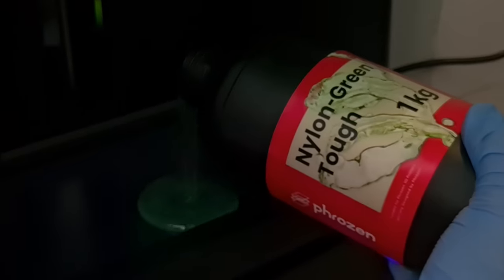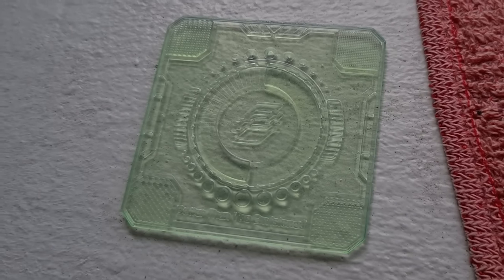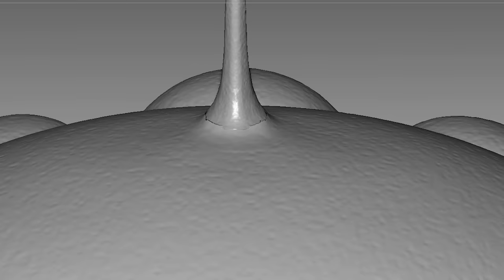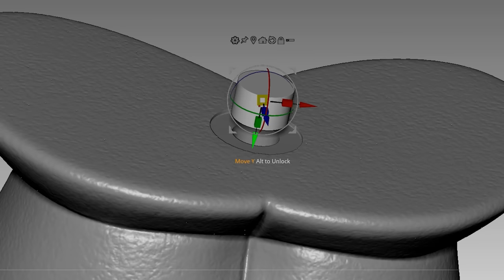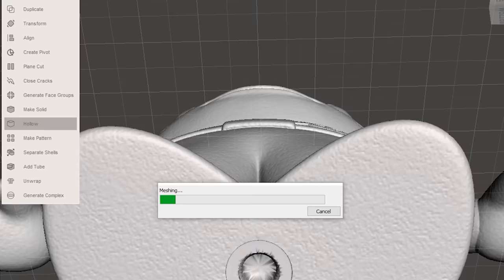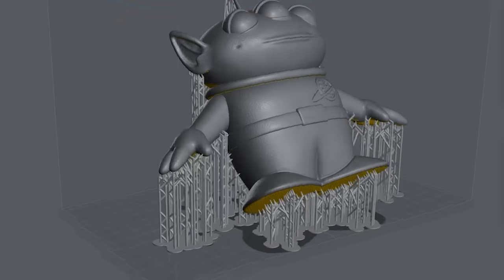Today I'm going to use a resin with a slight flex, and this is where you should stop filling — otherwise it might overflow. I did some quick exposure tests and it looks great. So I started preparing our 3D model. Obviously the first thing to do is to retrieve the thin antenna and replace the thick one. I added some noise to it and merged the ends together seamlessly. The next thing was to poke a hole through his end, because the factory dealt with the squeaker part and I happened to have the same squeaker size. So I followed their holes, which comprises a series of jagged edges — probably to hold the squeaker in place. Then I shelled the model with a thickness of 2mm, placed some holes in inconspicuous places, and we are ready to print.